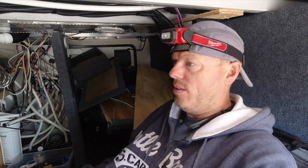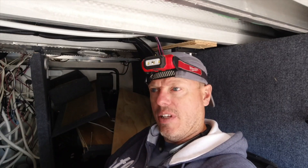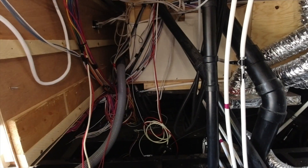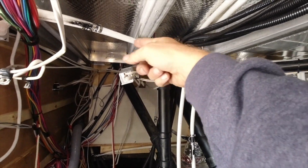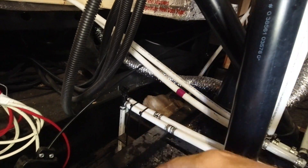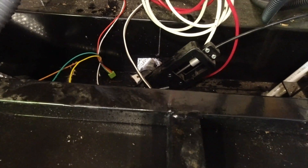In the newly found cubby space, there was a ridiculous amount of plumbing just crisscrossing. We made an agreement and went ahead and organized it a little bit better. Now all the plumbing comes down one spot — takes care of the bathroom sink, the toilet back over there on that wall, this goes into the washer dryer, and I believe this goes to the kitchen. The low point drains were just hanging out over there, not even pushed down through. I went ahead and got those in place, strapped them down, and put a little bit of steel wool on them to keep the critters out. I need to stick a little right there too — I can see light through that hole.